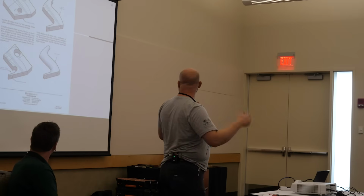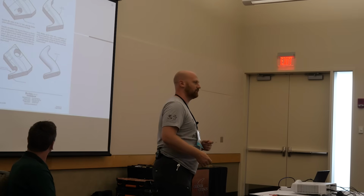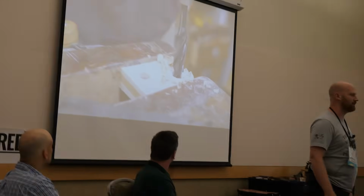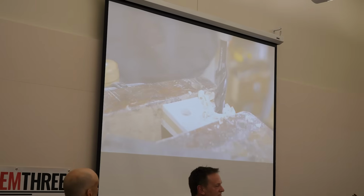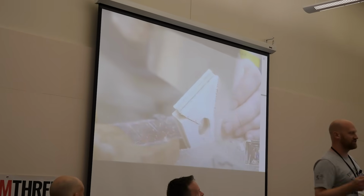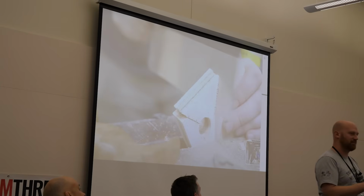And then you can come through, cut out the majority of the waste, and then with file and rasp, shape it down, or sandpaper, or belt sander. I like to bore them out with a bit and brace again. But again, I'm weird. Rex likes to pull out a drill. And then for doing the cutout, I used to come in with a turning saw and follow that line perfectly with a turning saw, or use it on the bandsaw.